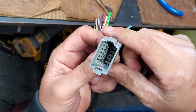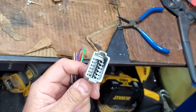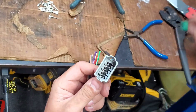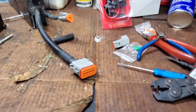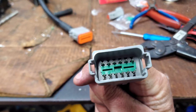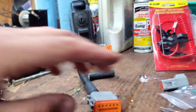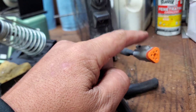That's not the position it needs to be in but I wanted to show you. This piece drops down in there and holds those tabs back on this side so we never have to worry about those pins popping loose. We've got both of our sides — there's the first side and here's the engine side. You can see the green retainer piece in there that keeps those pins locked in. I still have to put the other connector on the boat for the three-pin, but we've got a new kill switch cable to hook in underneath there.